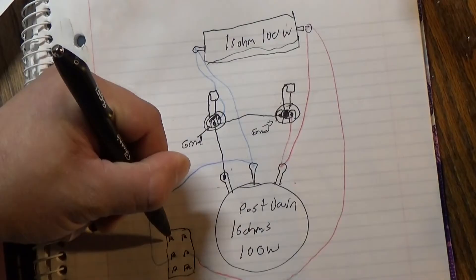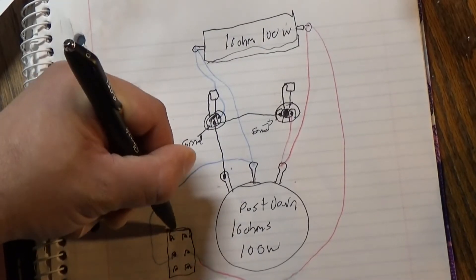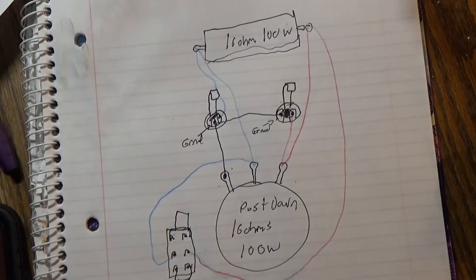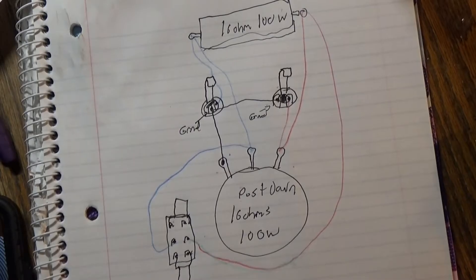Now this switch is actually a bright switch, and we're going to experiment with some capacitor values to see what we get. The capacitor values listed on the internet are way too low — if you find a schematic for this, don't expect those to work. I'll probably be using a 30-microfarad and a 100-microfarad capacitor, as that's really the only way I can hear a difference.